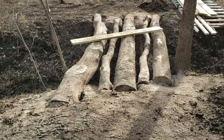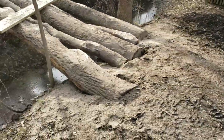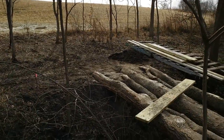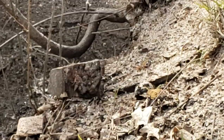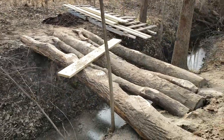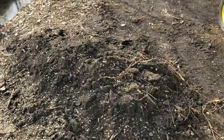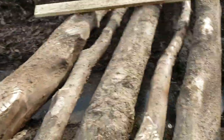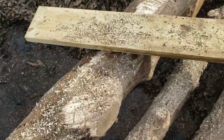All right YouTube — that chainsaw process was horrible, as you can see from the sawdust in every direction and chunks of wood flung and strewn all around. I just got done cutting the knots and high points that I could see off of the logs, and I'm sure I'll discover more as I go. The sawdust is actually kind of appreciated now because with this warm weather and all the dirt scraped up, it's been a muddy mess. I've been cross-hatching and then cutting out to try to make flat spots.